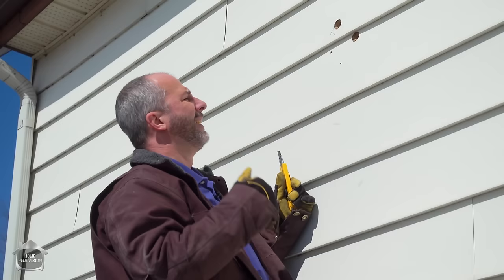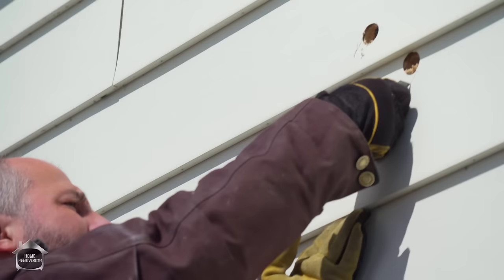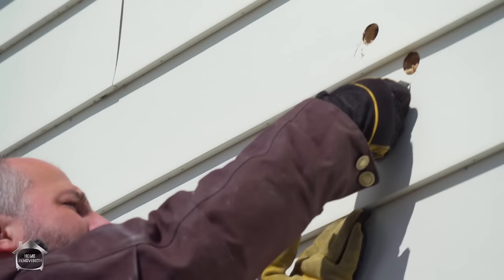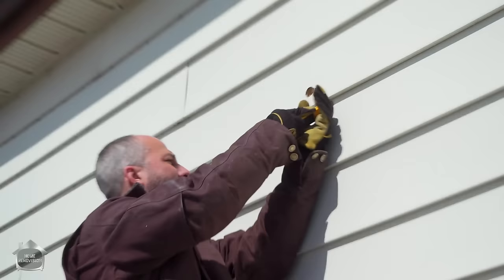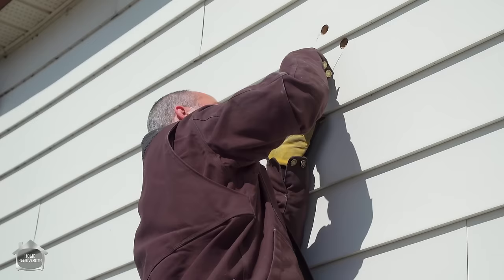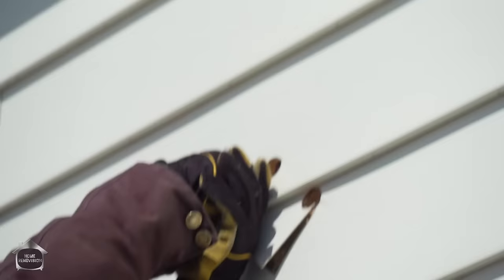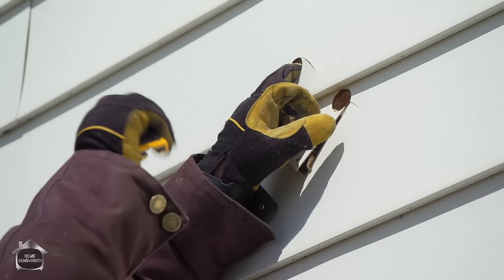Create that diamond. If you have wood siding just use the saw; if you have brick, you've got a little bit of chiseling to do. For me I'm just going to connect the dots with my knife. It's springtime — only a couple of degrees — but vinyl siding in the sun is generally pretty pliable and will cut nice. If it's cold outside it gets brittle, so you might want to wait until it warms up. I'm not too concerned here because we're eventually planning to change all the siding on this building.